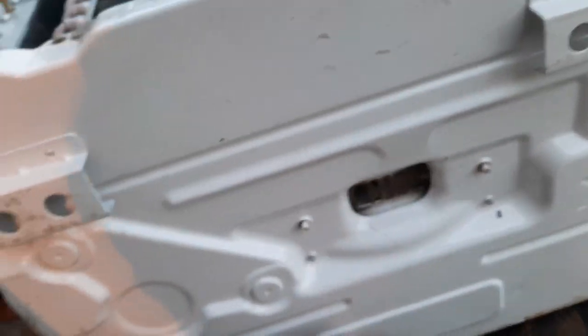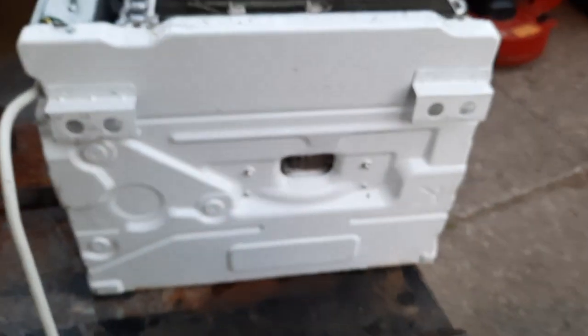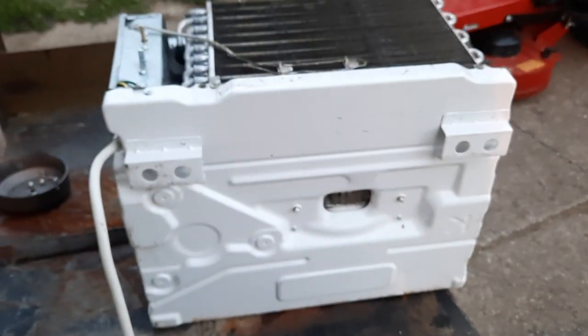it out. Also, I'm probably gonna get a drill out here and drill a drain hole in it, so we can get water drainage. I'm not too worried about drilling it right where everything comes out here. I always put it right underneath the slinger ring of the fan because that's always the lowest point of the unit. And it guarantees the same with this one. So right here, maybe over here, just so it's in the center of that. So I'll get that drilled out so we have a hole there. I'm going to check to see if there's any coils there, which there isn't, during pretty much the whole duration of that area. So let's get back to this.